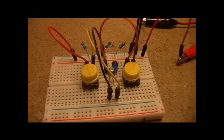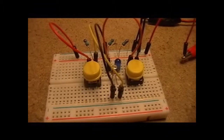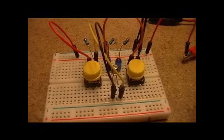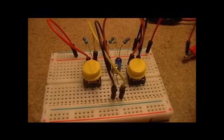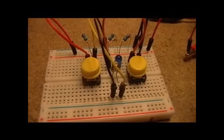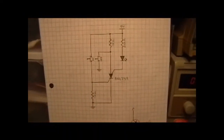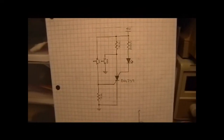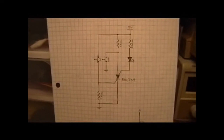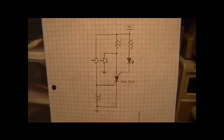Hello, my name is Jonathan Biznett, and in this video the circuit I have for you uses a silicon-controlled switch, very similar to an SCR, but it actually has an additional lead. Let me show you the schematic for it here, and I will attach this at the base of the video description. In it you'll see we have our silicon-controlled switch, or SCS.